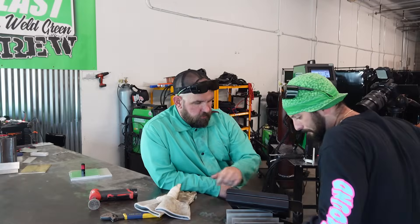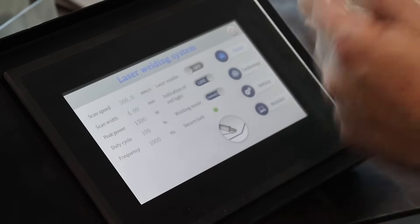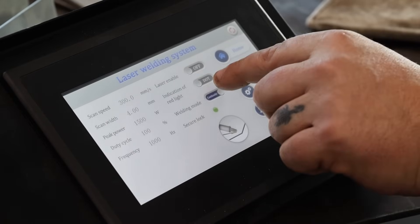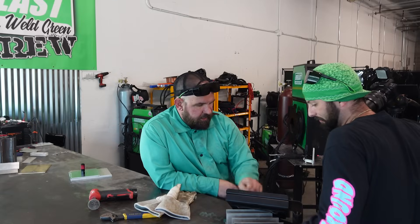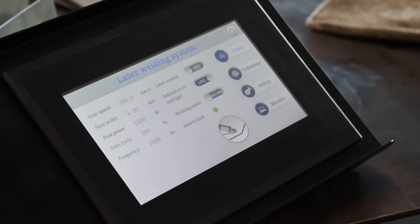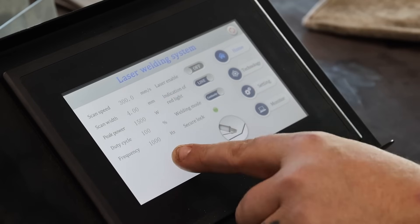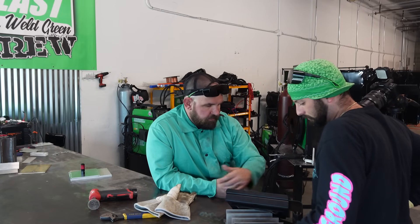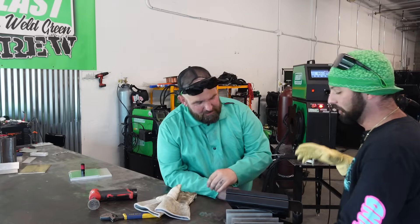Here's your main control for the laser power unit itself. We're in laser welding mode. You have your basic parameters — enable and disable. When you set the gun down you can turn the laser off. You can show either a line or a dot for your pilot laser, the red line. We have a continuous, spot, or pulse welding mode as well — we'll leave that on continuous. Here we have all our basic settings: frequency controls how fast the laser is scanning back and forth. We're at 100% duty cycle even at 1,500 watts, running a four millimeter wide bead.